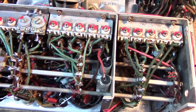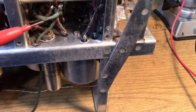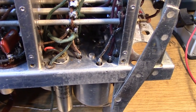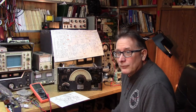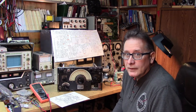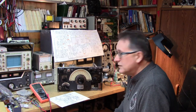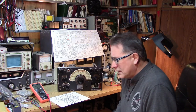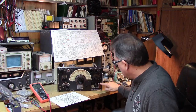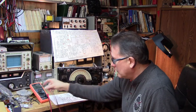There's a grid cap wire going through a grommet in the chassis up to the first RF stage. This grommet is completely petrified. I've got some small grommets I'm going to put in to replace some of these. Okay, we're finally at the part a lot of people have been waiting for - let's start to see if we can apply power to the set to light up some filaments, see if the high voltage will go in without smoking something, and start to bring the stages up one by one. We've got a Jones plug right in here where we're going to be applying power and doing some continuity measurements with our meter.